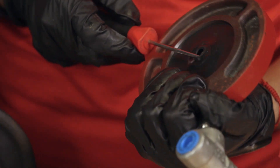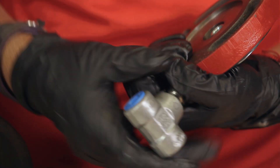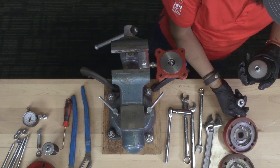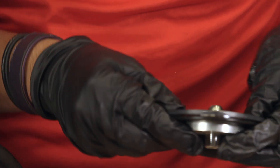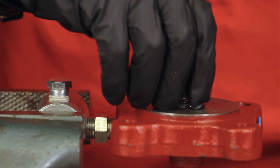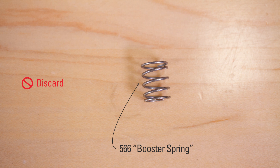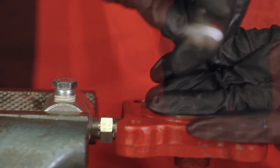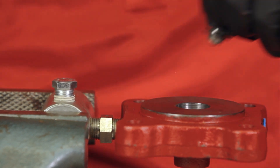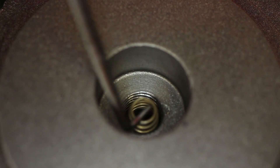Remove and discard the diaphragm. Set the diaphragm plate assembly aside — we will disassemble this in the vise later. Remove the spring from the top of the seat. Loosen the seat and discard. This is sometimes called a booster spring. Loosen the seat with a socket wrench and discard the seat assembly. Remove and discard the spring from the base.